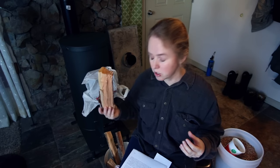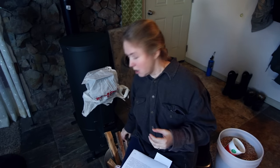Once I was using these pieces, the stove would cool down, it would keep going, but it would get very sluggish. The pieces that it really liked were half an inch, eighth of an inch. That was the size that it really, really liked. It liked legitimate kindling. Now, in order to keep the stove hot with cordwood, I had to put that tiny, tiny kindling in and come and refeed it every half hour.